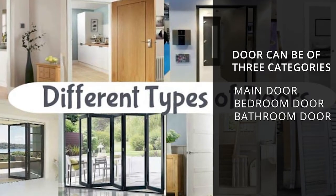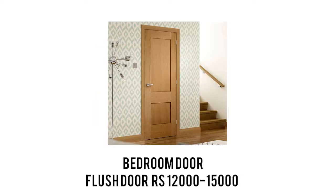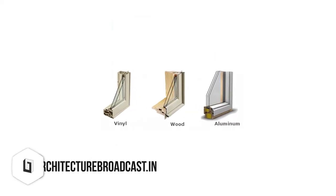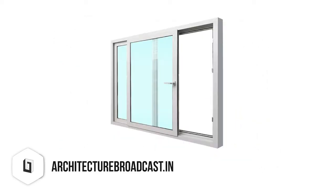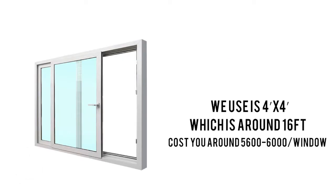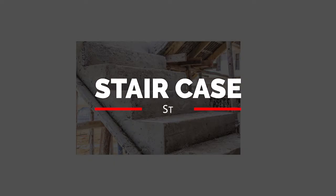Next are doors and windows. Doors fall into three categories: main door, bedroom door, and bathroom door. The main door is usually teak wood, costing ₹25,000 to ₹30,000 including key lock and carpentry. Bedroom doors are typically flush doors costing ₹12,000 to ₹15,000. Bathroom doors are usually PVC, costing ₹3,000 to ₹5,000. For windows, sliding PVC windows cost ₹350 to ₹370 per square feet. A standard 4×4 feet window (16 sq ft) costs around ₹5,600 to ₹6,000, not including metal grills.